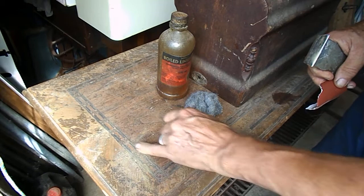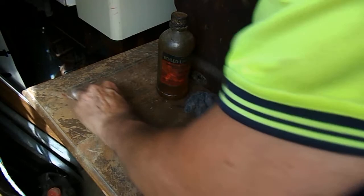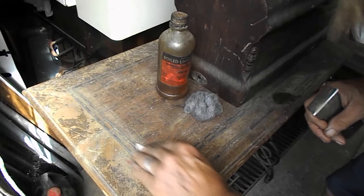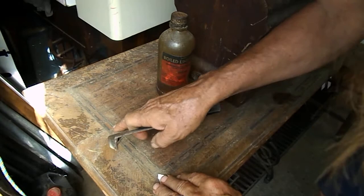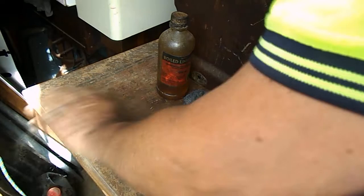When it's really old, you get high spots on it, which makes it very difficult to get the scraper on there. So we just get a 140 or 160 grit sandpaper and very carefully work just the marquetry area. We don't like to do this too much, because you can see what happens — the high spots get sanded back. All we want is for it to be smooth enough, like it is now. There's your shellac powder.